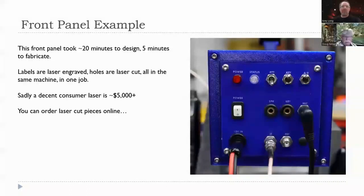And so if acrylic plastic is something that you want to use, a carbon dioxide laser is still the recommended tool. Now, if you are fine making this out of wood, you can cut through 1/8" Baltic birch plywood really easily. That can also engrave, and you can do that with one of the $800 to $1,000 lasers that you can get on Amazon. Are there places you can send the design to get it done?